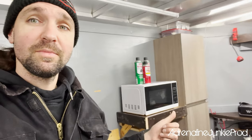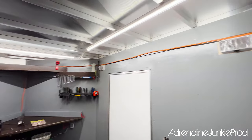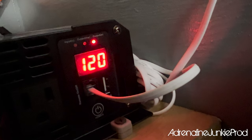I know I've got the generator for the bigger stuff. The 700 watt microwave from Walmart — just a $69 microwave — can easily and happily run off the battery bank. This one bank of four lights runs about 120 watts total. When we're away, the only thing I'm going to be running off the batteries most of the time is just the lighting and charging stuff, so I don't really have to worry about too much strain on the batteries. If I need more juice, I'll fire up the generator. Don't get all caught up with solar and battery banks unless you really plan on going off grid — bang for buck, you're still better off with a little generator in most cases.